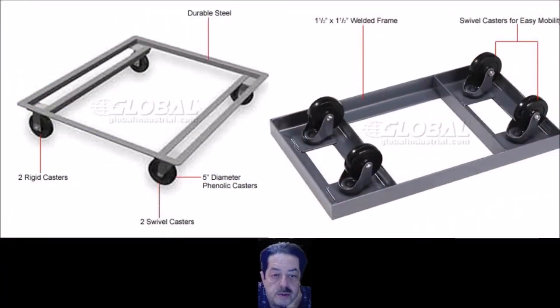These pictures are from a manufacturing company called Global — they sell these, but the purpose here is not to buy them. This gives you a rough idea of another method. The note says 'rigid casters' — yes, you want really good heavy-duty casters, they're going to last you much longer. I get them with a wide wheel. You want to put the rigid ones in the back, at least two, and then two swivel ones in the front — or any combination you want — but two rigid, two swivel is pretty standard.